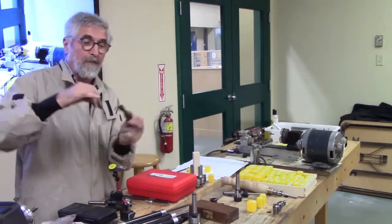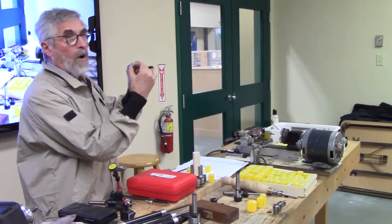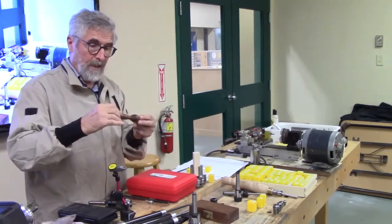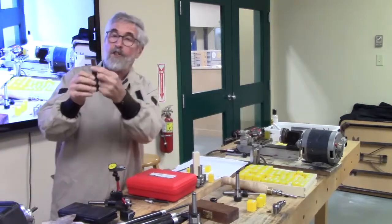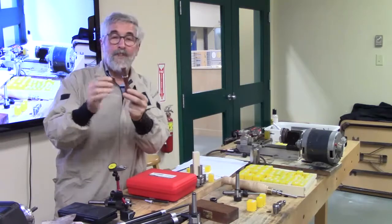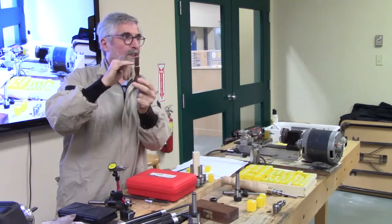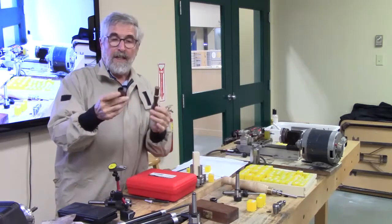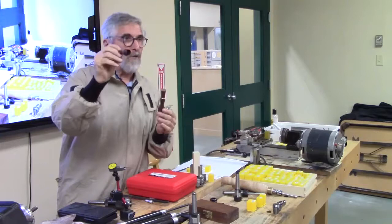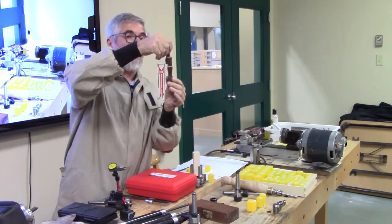And the reason I did that, because I wanted a very thin wall here so that I could cut it out so that it matches the ring. So the idea is that your ring goes in like that. It's about the thickness of the ring. This will eventually get cut off at an appropriate height here. And then using another collet, gripping on this end, I was able to make a matching piece cap that's gonna go over top of this.